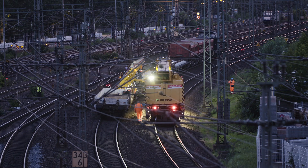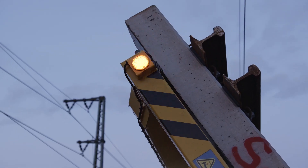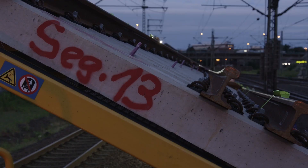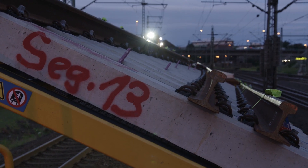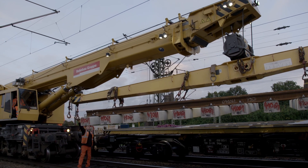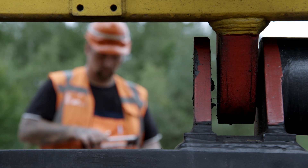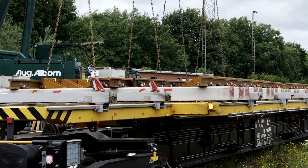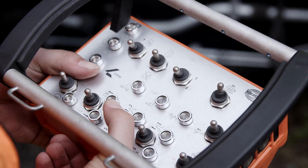The loading platform of the Switch Tilter uses hydraulic cylinders to tilt up for transport and down again for loading and unloading. We have managed to reduce the platform height to a mere 1.4 meters, making it easier and quicker to unload the switch segments, even below overhead lines. The loading platform can also be shifted sideways, allowing the adjacent track to be kept clear for oncoming traffic. All these movements are easy to manage with remote control.